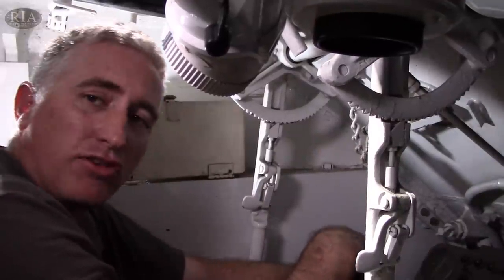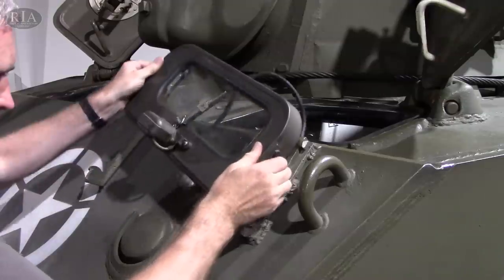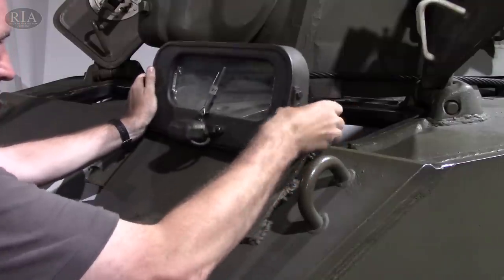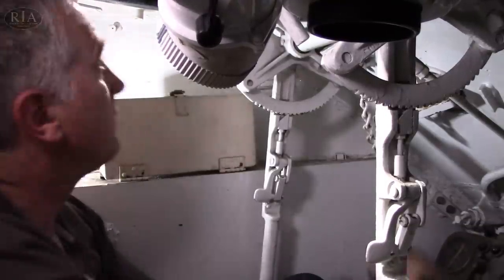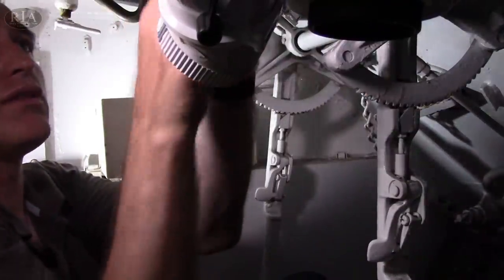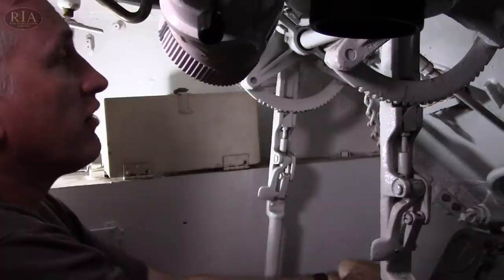I am going to hop over to the driver's side. Life is great for the driver. He has a seat which will adjust all of 3 inches forwards and backwards, and 9 inches up or down, for open hatch or closed hatch operations. For open hatch operations he does have that windshield — very simple clips, a very nice design actually, and it even comes with a wiper cable. You place it into the receptacle for power and your wipers will work as you're driving along. However, the standard way of driving around in this vehicle is with the hatch closed. It's a fairly simple pull-down and it locks into place with a simple latch. So you're now driving around with your periscope which you can adjust in azimuth as well as in elevation. And with only one pedal to worry about, he's got a fair bit of leg room.